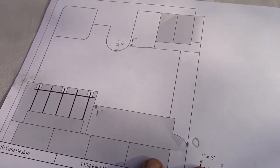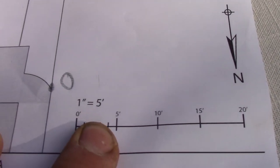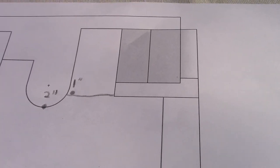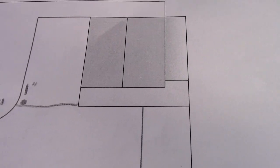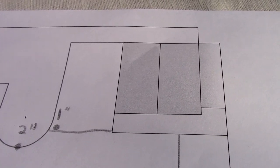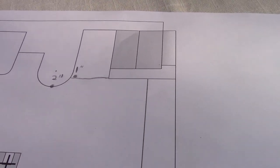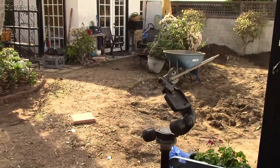Right here is the exit point of the water — that's the zero point. Where the water comes in off the roof is about an inch higher than that. I've got some reference points back on the bricks around the mound — that's two inches higher than the exit point. The spillway of our urbanite basin back here is an inch higher than that exit point, so when it fills up it's going to flow into another basin. That's why it's its own little basin back there.